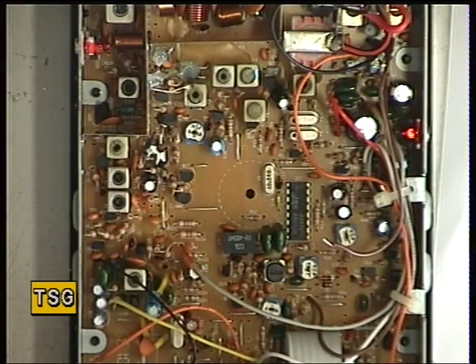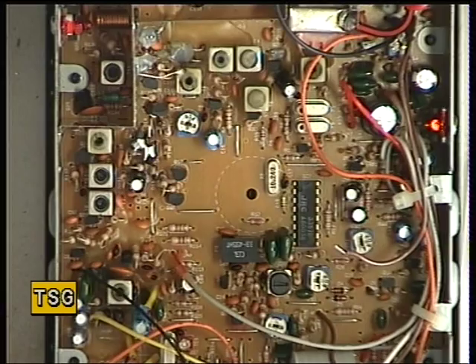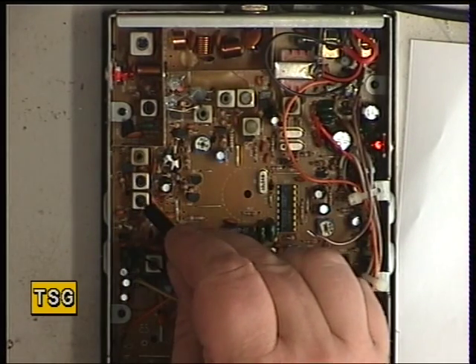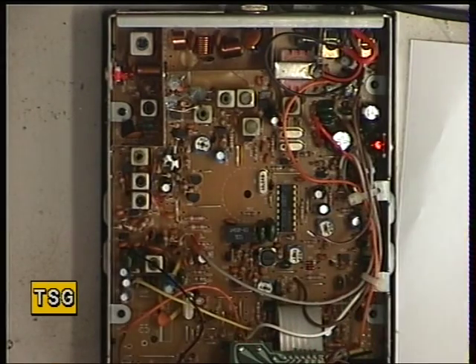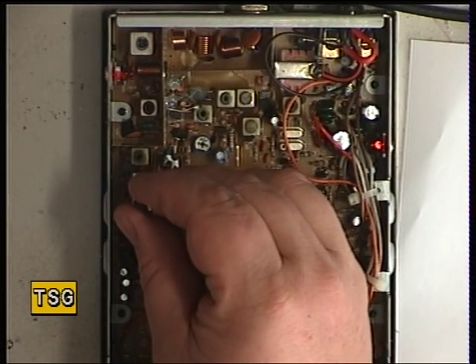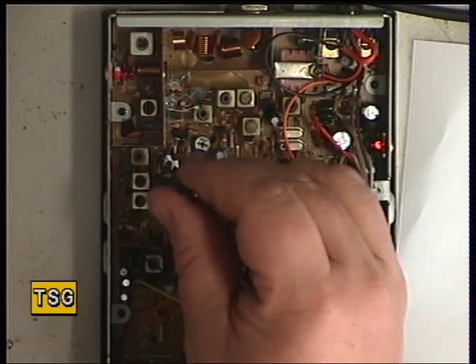I will admit I've no idea how the VCO is done. So straight away this radio is doing 3 watts, and so straight away we'll go for transformer 8 in the transmit section — transformer 8 is this one here. It's just over 3 watts: 3.2.